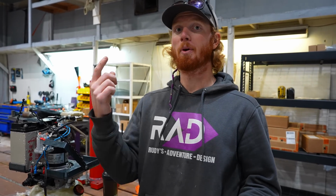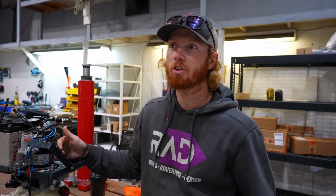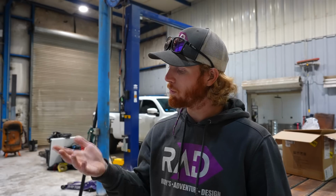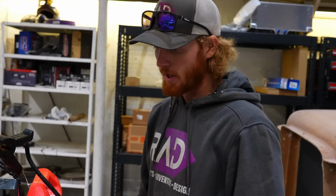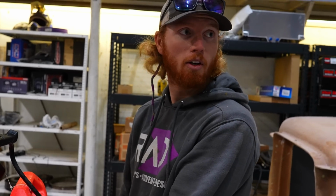So there's only one port on these and they only push one way, but what if we hydraulically suck the oil out of them to collapse them? In theory, it should work. If there's any sort of air bubble or anything like that, it won't work though. It'll stop, right? It should. It's gonna cause problems. Would it be enough to suck it up though? We want to see if the pump will run in reverse first. But I'm gonna have to clean up again. Need a bucket. If we did do it backwards, it should technically suck from here.